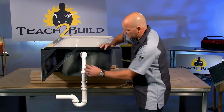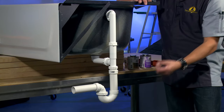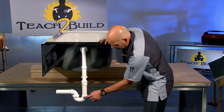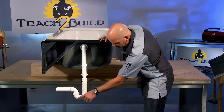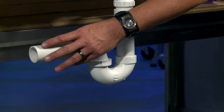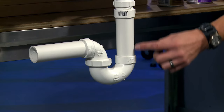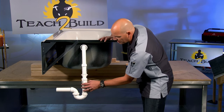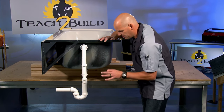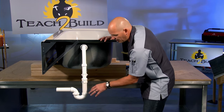The basics of the drain are just the standard drain system that virtually any drain — from a toilet to a kitchen sink to a bathroom — have in common. They have this section here called the trap. It uses water to trap sewer gases further down the drain line, because if the sewer gases could make it up inside here, they would be up inside your house. You'd be smelling that methane smell, and there are some dangerous risks there. So we want to keep those sewer gases where they belong, further down the line.